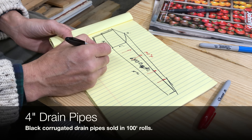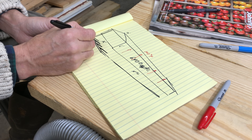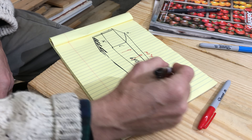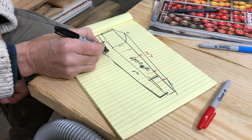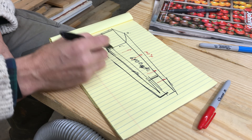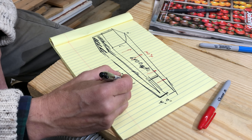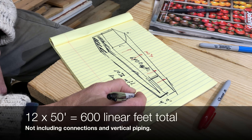What we're going to do is run pipes under the ground. These will come down four feet, turn, and run the length of the building. There will be six pipes going back all the way across the whole bottom of the greenhouse, coming up in a return corner. We're also going to run an inlet pipe from the back corner down two feet, all the way back, also with six pipe lines. So we've got pipes running at two feet and four feet depth — that gives us roughly 600-plus linear feet under the ground.